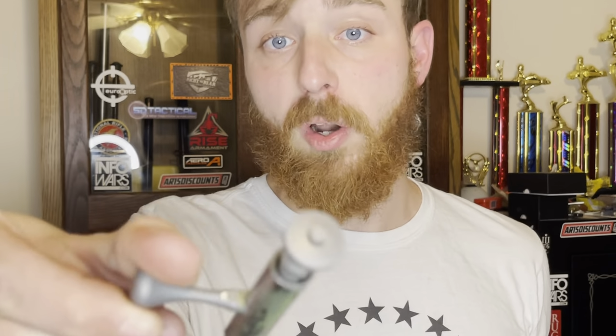It looks a little dirty because there's a bunch of oil on it, but I polished down the bolt. And then for the bolt handle and the hammer, the charging hammer, the pullback, I sandblasted it. The nice part about sandblasting good old steel like this is because it turns up such new, fresh raw metal, and it puts a 100 grit finish on it, almost like Cerakote.